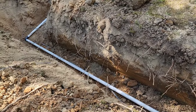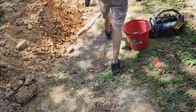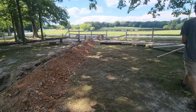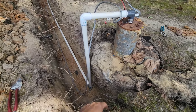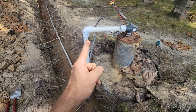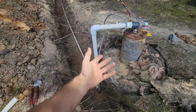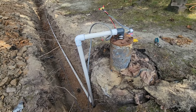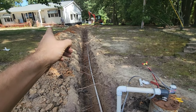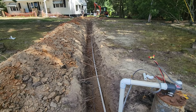Elbowed — gotta pull the slack out of my wire. We're heading to the well now to hook that up and then under the house we go. Just finished plumbing up the well head — real simplistic, no need for a spigot or a boiler drain out here because they have a concrete cover and they would never take it off. So we just went ahead and used some elbows and brand new wire. Time to cover up the ditch, but first we're going to go hook up the tank under the house and energize the system to make sure we don't have any leaks before we cover everything up.